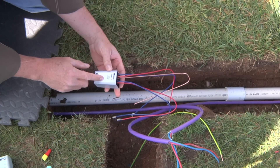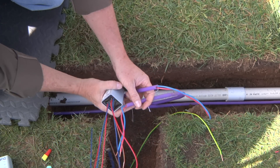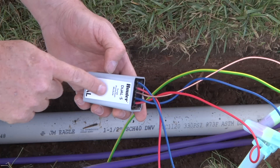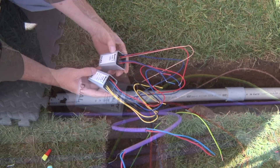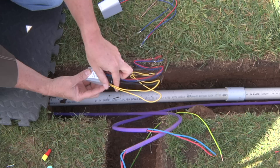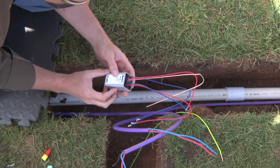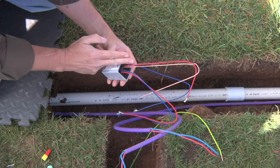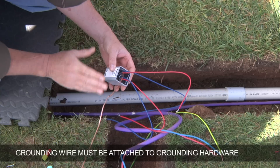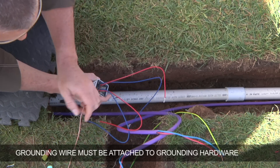Here we'll be connecting a dual-S surge decoder onto the existing two-wire path. I've pulled up about five feet of slack, or about 1.5 meters, out of the valve box area. You'll notice something a little different about the dual surge protectors as opposed to the dual station decoders. The station decoders have their red and blue wires to connect to the wire path and their two individual station outputs — and you'll notice there's no grounding wire on the station decoders. The dual-S surge protection modules have the red and blue wires heading in and out, as well as a grounding wire that connects to your grounding hardware. You must attach this to your grounding hardware, or this decoder does nothing. If you simply install the reds and blues in the line and don't attach this to your grounding hardware, you'll be serving no purpose.